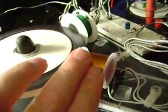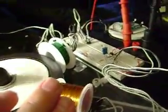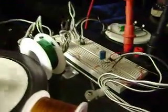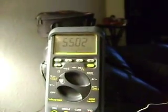With a much larger coil, I can imagine those volts being up into the hundreds of volts, so the capacitors are going to have to be a fairly decent size in voltage — I'd probably say 150 to 250 volt range for sure, maybe even more.